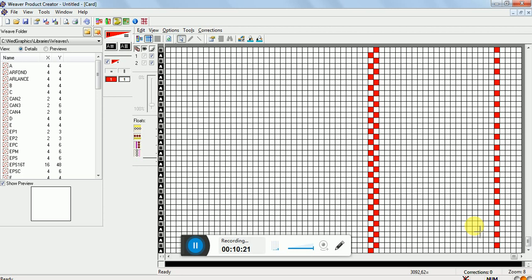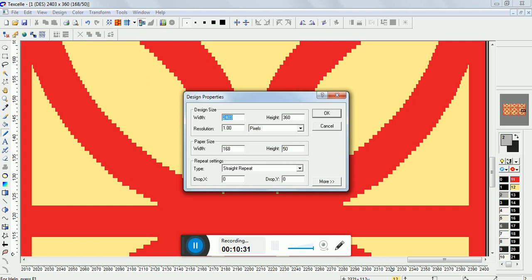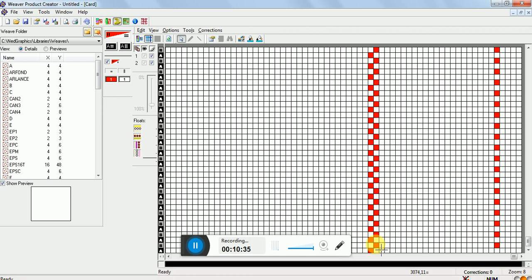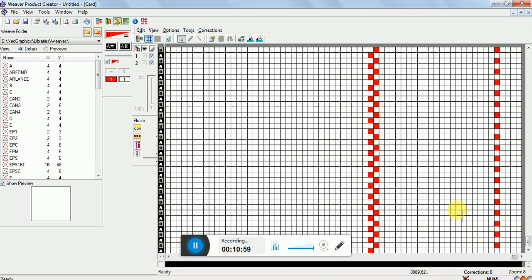When you are going to set on loom for this design, see here, picks per inch is 50, okay, and here I took the second number finger for cramming. Cramming is nothing but weaving without counting a pick. The picks you give on the loom are only 50. After weaving, in the fabric you get 100 picks per inch, because cramming is not countable on the loom, but it is in the fabric.